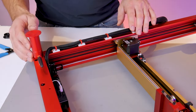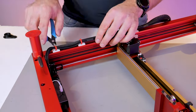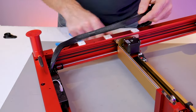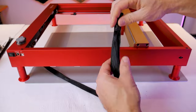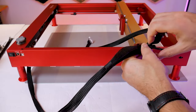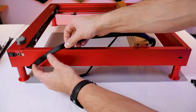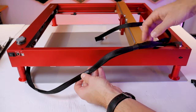Next I'm going to remove a portion of the harness that's sitting under the frame member that goes to the main board. Mine is attached to the underside of the frame member using adhesive cable tie clips. If you installed yours according to the X-Tool instruction manual your harness might be on the inside edge of that frame member. Regardless of where it was, now it's free and can be placed outside of the frame. I'm going to start to remove the electrical tape wrap because this is actually two harnesses held together with this tape.